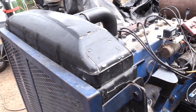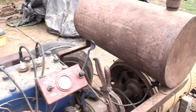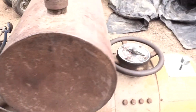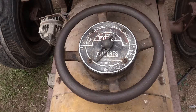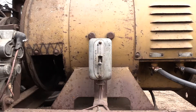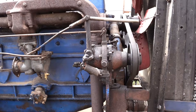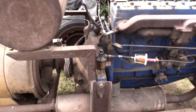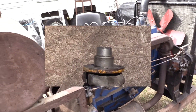We obviously can't use that, so what's this? This is a loaner — it's a 1929 flathead Dodge 6 throttle control. It's 250-amp DC, with low and high range on the bottom switch, and this is how you adjusted the amperage. What a tank. There's the polarity selector switch, the exciter and the coupler, a belt-driven governor, and an updraft carburetor with no air cleaner. It runs at 1,800 RPMs — slow and quiet. Deluxe. You could say it's got character.